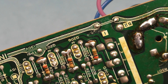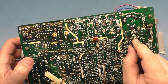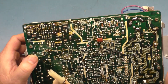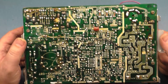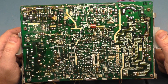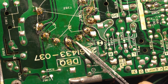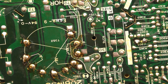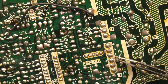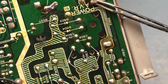That's really the only thing that leapt out at me. With the symptom of dimming in and out, I am very confident this is our problem. The flyback could use a good reflow, but the joints all look okay for what they are. The video header pins could use a reflow — none of them are cracked, but there are a couple that are pretty thin.